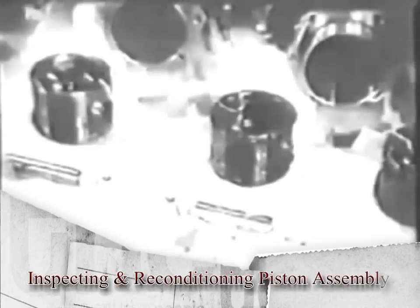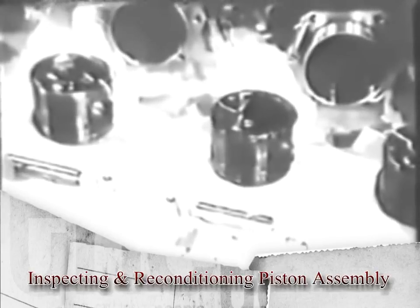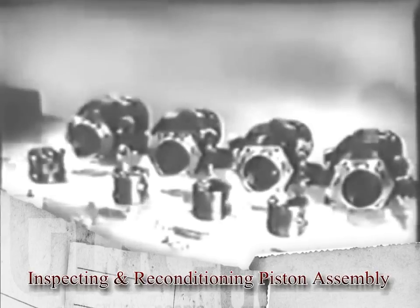You've now finished reconditioning this cylinder. When the other three have been gone over in the same way, the next job will be on the pistons. You'll have to scrape and clean them, inspect them carefully for defects, measure them to check clearances, and finally install a new set of rings. After the cylinders have been reconditioned, the next job is to clean, inspect, and repair the piston parts and check clearances to determine how much wear has taken place. You'll find an exploded drawing of the piston assembly in your engine manual.